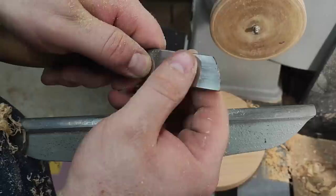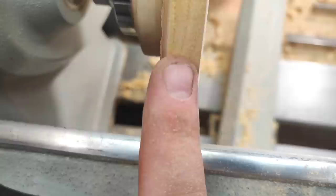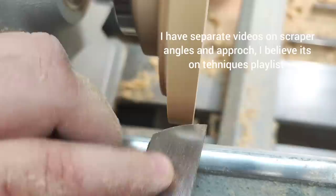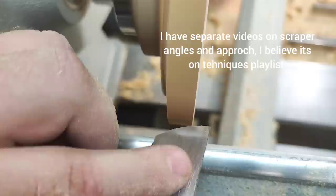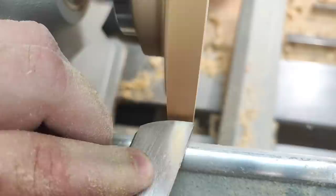Here's a roughing cut so you can see how badly torn-out the surface is. This is the end grain part, this is side grain — a little bit cleaner — and again end grain here which is badly pulled out. The scraper edge has to be at less than 19 degrees on the incoming wood, and use a light touch.